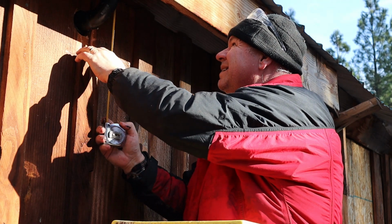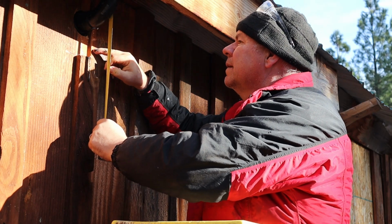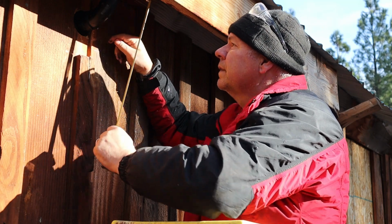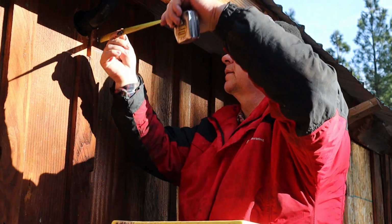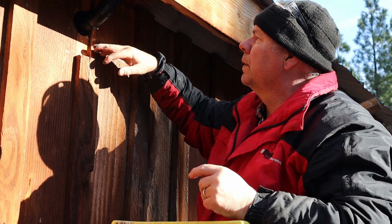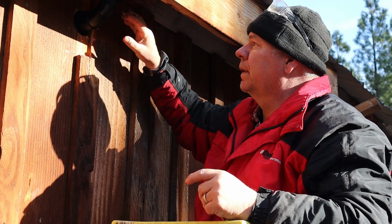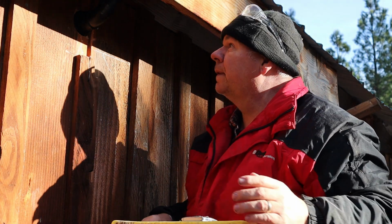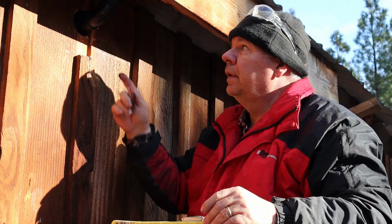And from this level line, yeah, it goes up 6.5. This is the bottom of the header coming up. It's up about 6.5 inches, so about 1/2 inch of this is going to protrude above the header when I'm done. But I'll have to notch it out when I put that header up there. In fact, I'll probably lay some of it out. Right now, I can't lift the header up on there, and I want this to seat up a little bit, especially since it's cold. So we'll pick this up on the next video. And I'll put this header on and show you that notch that I had to do for that vent.